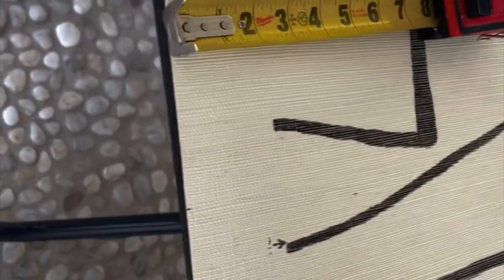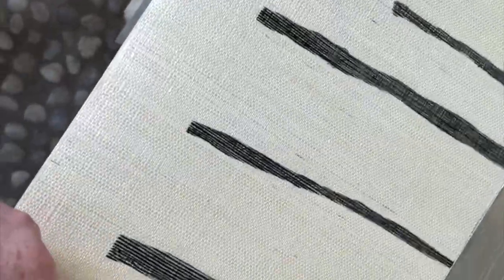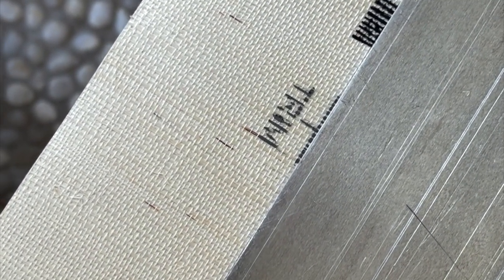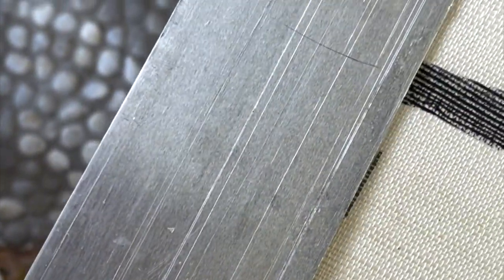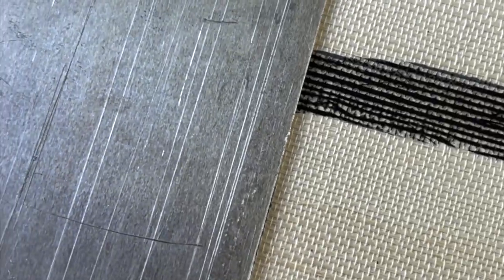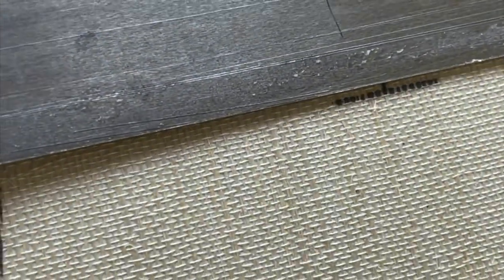We have our table and we have our product on the table. So we begin our investigation. We have our trim line. I'm going to tell you right now, I've made this mistake before when I first trimmed the wallpaper — I didn't trim off the whole line. And guess what was showing? That was showing. So I don't want you to make that mistake. See that? That line has to be gone. You see that little black showing there? Make sure that when you have your guide set, you see a little of that white on the other side of that black line.